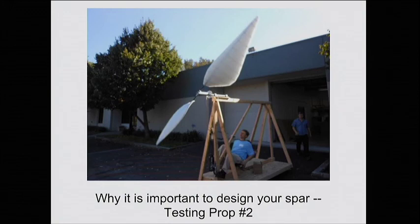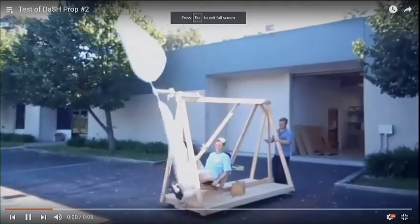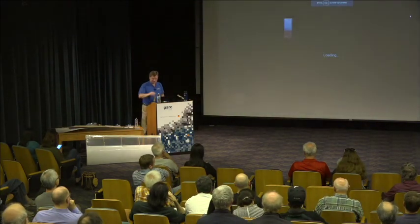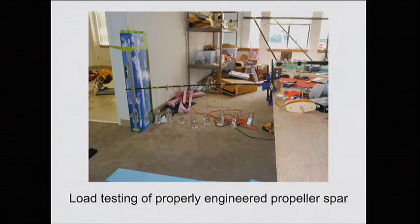This is our second prototype prop — we built it just as a practice, but it looked like it might be a decent prop. The engineered prop spar with spar caps designed to take the load wasn't ready yet, so we used carbon fiber ski poles that were the same size — and this is what happened when it broke. We did eventually test the prop spars. Basically you take bottles with the right amount of water to give elliptical loading in a prop — it's more like a triangular loading — and prove it can withstand the biggest load you're going to put on it. All the props we've built since then have been just fine.